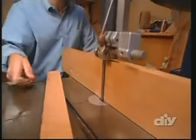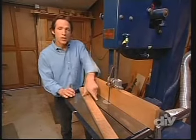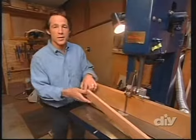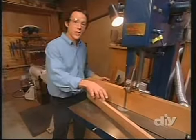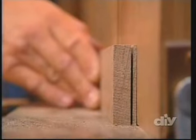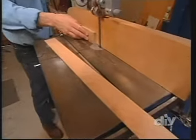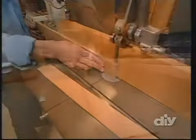To cut our quarter sawn oak veneer, we'll set our band saw at a sixteenth of an inch — that'll give us a healthy thickness of stock to work with. It's also important to use a good sharp blade, especially when cutting pieces this thin, to ensure an accurate cut. We'll cut two pieces of stock for each leg. Once cut, we glue the veneer to our leg stock, trying to get a good grain match between the veneer and the patterns on each leg. Masking tape helps keep the veneer in place while it takes about two hours for the glue to dry.